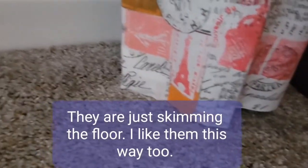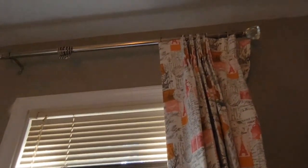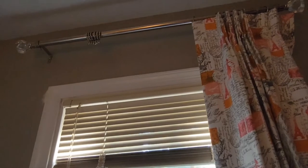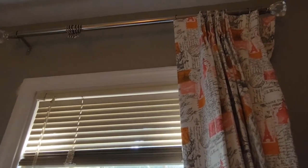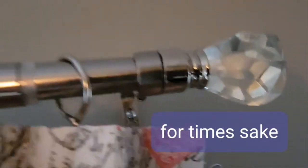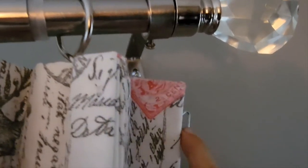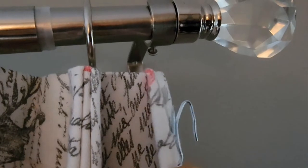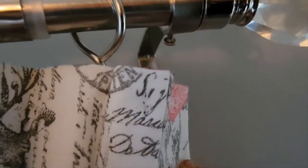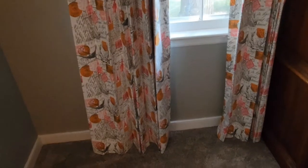You can see there I still had some adjustment up or down, but as it turned out, this is exactly the way my cousin wants it, so we didn't have to adjust anything. Now, normally you would put two screws in there, but these curtains are pretty light, so I'm just going with one screw. The way to professionally do it is you get an eye hook, you leave one of these hooks free, you get an eye hook and you screw it to the wall, and you connect that to the wall like that.